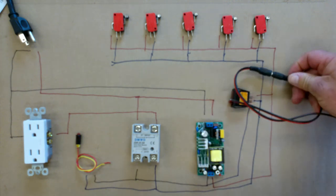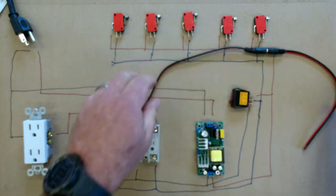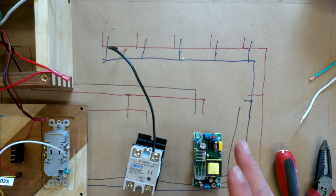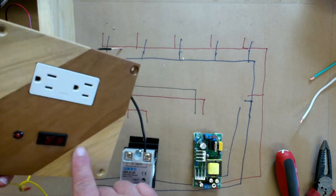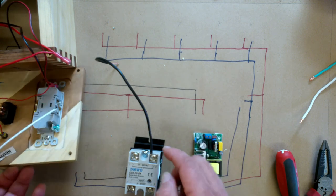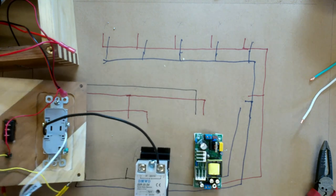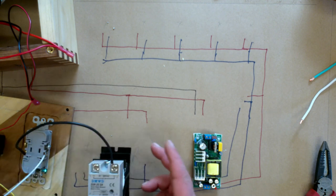So let's go ahead and put these all together in a nice box. Right here where it comes in and out of the box, this is just a regular 3.5 millimeter connector, and I'm going to place that right there so that all of this will be in the box, with the wiring outside the box so you can just plug them in and out. So we've got everything kind of laid out — the indicator on the back, and the switch. Here is our relay, and this is the hot coming off of our relay, which is going to go into our outlet over here. We're going to connect that to the gold terminal there.